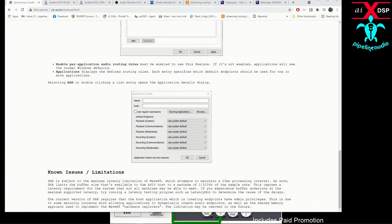And I'm not sure if I'm finding any with ADAT out that are bus powered. Do you guys know of any, or is that just asking for too much from bus powering? I mean, it shouldn't, because my RME Digiface USB has 4 ADAT ins and 4 ADAT outs and a headphone out, and it's all bus powered. So I think this could be done, but I'm not really seeing anything.